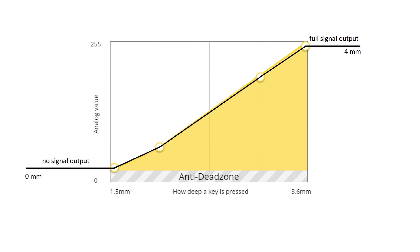The analog range is currently from 1.5 to 3.6mm, so there's a little bit of pre-travel in which no signal is accumulated, and a little bit of over-travel in which no extra signal is recorded. I don't know if these dead zones are intentional, but I suspect so, as having no pre-travel means the switch would actuate upon the merest touch, and having no over-travel means that you have to smash the keys and hold them down really hard to get full signal out of them.